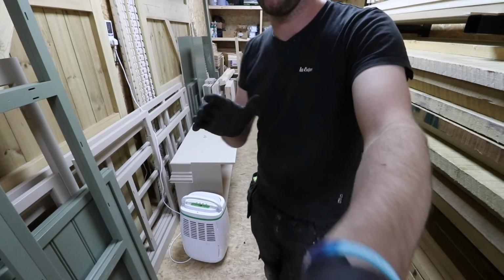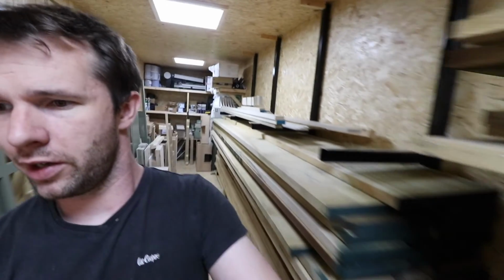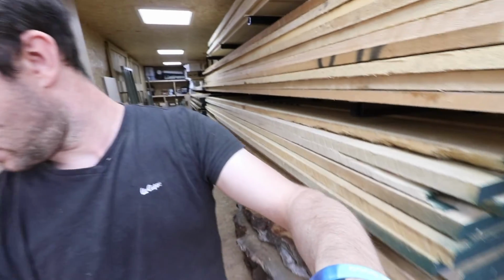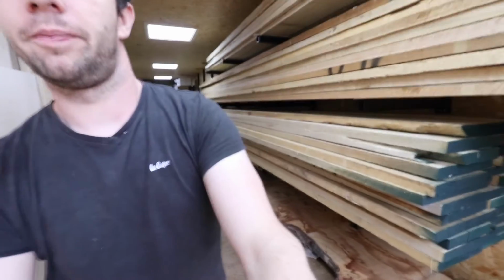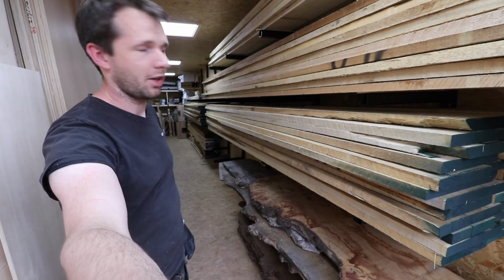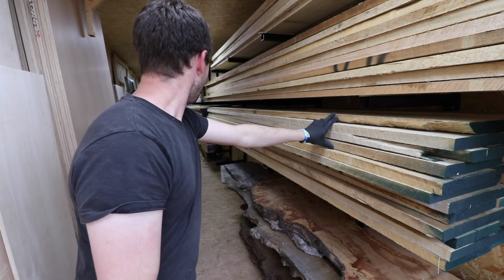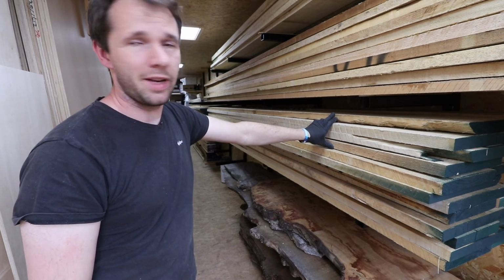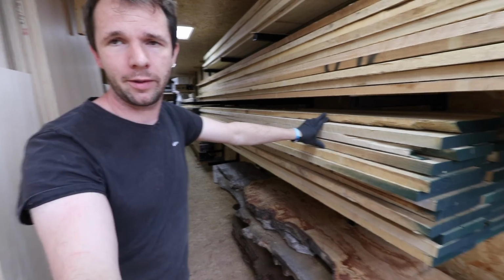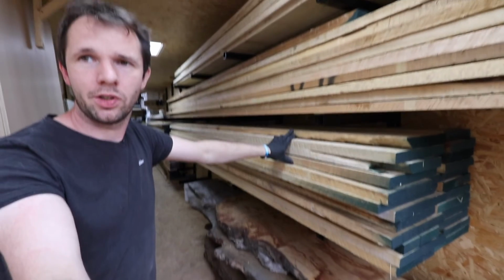And before I put all this new timber in, so before I brought the rack in, there's nothing new other than this timber that's gone into the container, and the dehumidifiers were actually only sucking out about 1 litre a week, so they're pretty much at a constant humidity in here before I put this timber in. So there is about 3 cubic metres worth of tulip wood gone in, so it's going to be a good test to see how much moisture actually comes out of it.